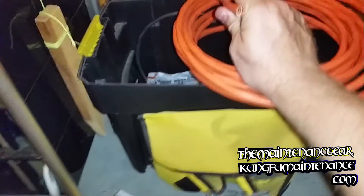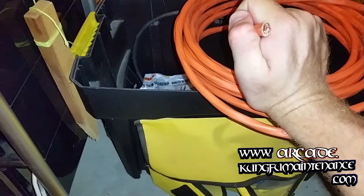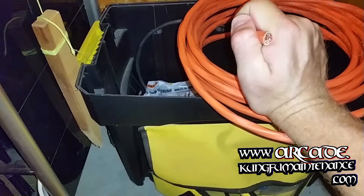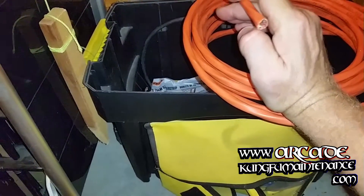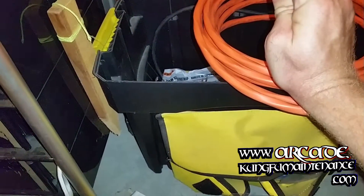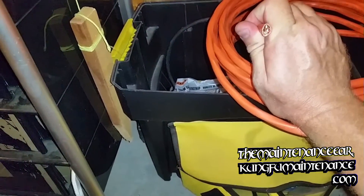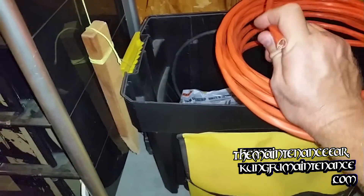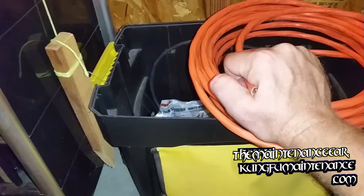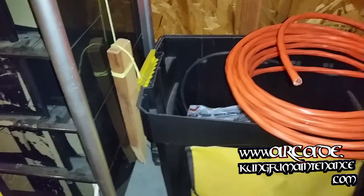This particular one is a 10-3 wire. It has three conductors — you can see the black hot, the red switched hot, the white is the neutral, so there's your conductors. And additionally it's got a ground in there. I think it would have been easier just to call it a 10-4 wire, as it has four wires, but the ground is technically not a conductor — it's just your safety ground.